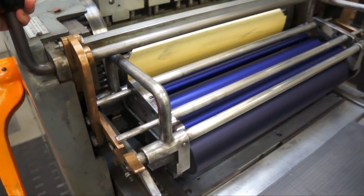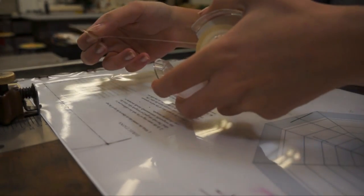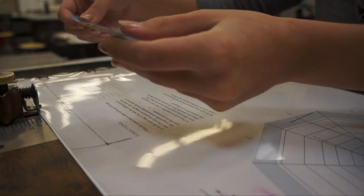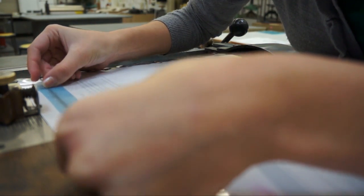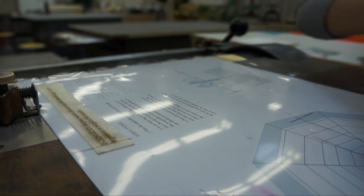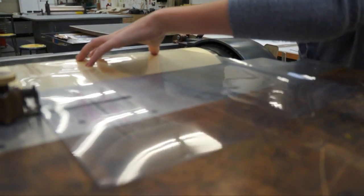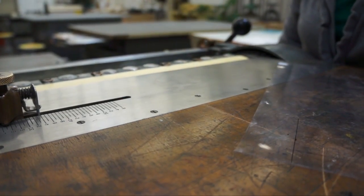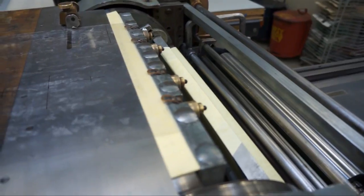It's important to note the handle which can raise and lower the top assembly. Raising the top assembly will keep the press rollers from running and also keep it from taking an ink to print. Here is a favorite technique for lining up photopolymer plates — this only works with plastic backplates but it's a very effective way of getting a perfect lineup. Using a sheet of acetate on top of your print and a little bit of double stick tape, you can place the print with the type side to the paper onto your guide below. Then peel off the backing, switch the press to trip mode so it doesn't ink, and remove your guide sheet of paper. Then simply roll the tympan down to the edge of the press bed, which will deposit the print onto the base. This works because the double stick tape is not as strong as the adhesive used on the back of these plates.